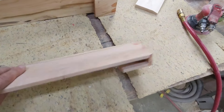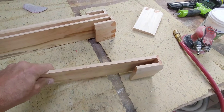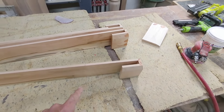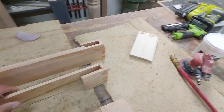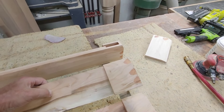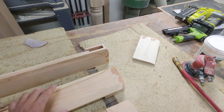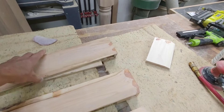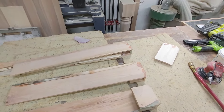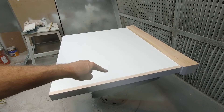Some of my other posts use this — it's a slip-on molding. I can basically just put my panel down and then slide that in, and it covers up anything on the floor. Everything now is Bondoed up. I like Bondo as opposed to spackling — I only use spackle on small holes. For anything like a nail hole I fill it with Bondo because it sands pretty well, the same as the wood I'm using. For paint grade it works great, so this is ready to be prepped and ready to go. I'm going to put a coat on here and show you a close-up of what it looks like at this point.